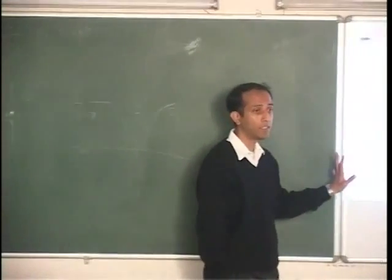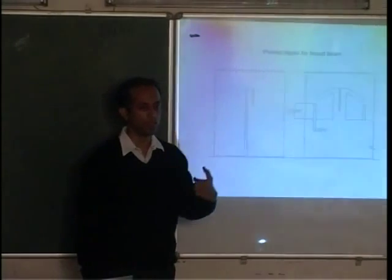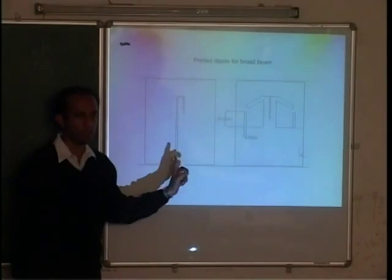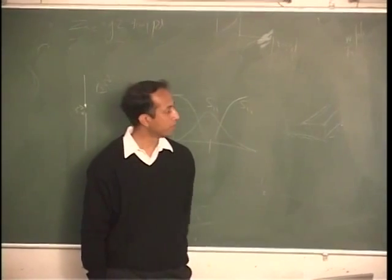So it can match with a coaxial cable. Okay, the coaxial cable also has two wires, center conductor, outer sheath. Current goes and comes back. So it can be connected easily here. Not so with a waveguide. Waveguide is one wire transmission line. So there are some complications here.